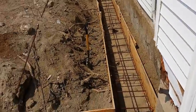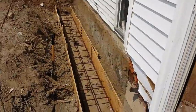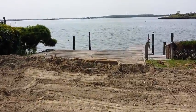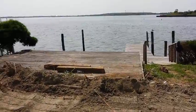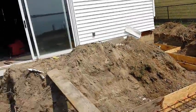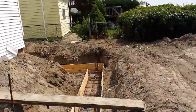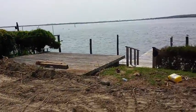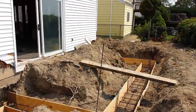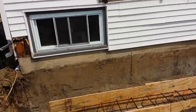It's quite a small job — a couple of bump-outs off the house. Like I said at the beginning of the video, the homeowner is bumping out this house, making it bigger. Now these grade beams require helical piles to be so adjacent to the water. Future flooding — we don't want these foundations to lift or heave. They will be well supported with helical piles.